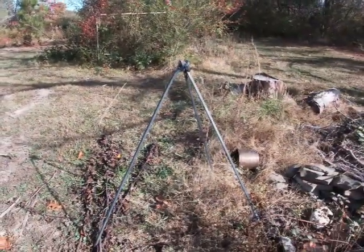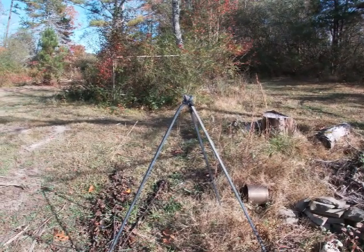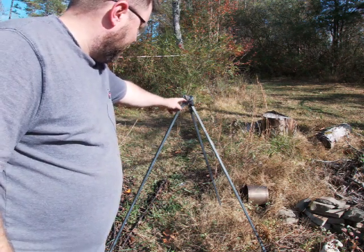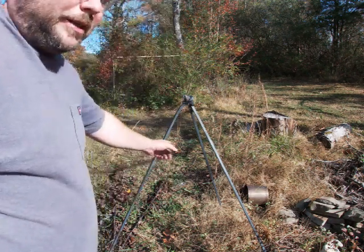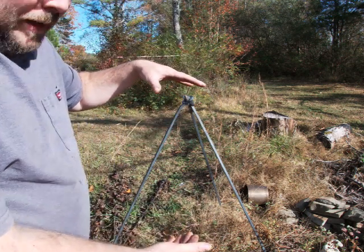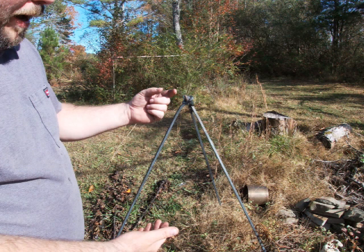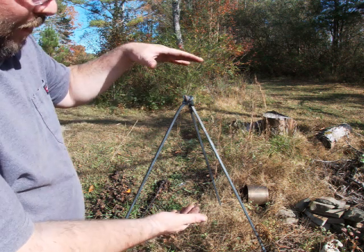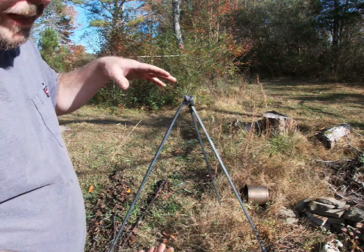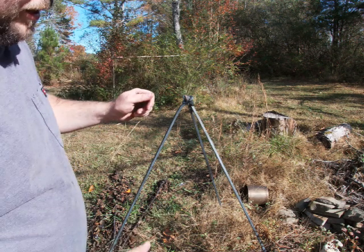Back up. Put together. Now, I'm going to talk about one of the two things we're going to be making. We're going to be making a hook called a trammel hook, which will hook right in here and hang down. Now, a trammel hook is an adjustable hook. It'll be about this big. It's made out of flat bar and round bar. So we'll be using a piece of about 1 inch wide, 1/4 inch thick, and probably about 1.5 feet, 2 feet long. And then your other piece is going to be 3/8 round bar, the same length. And what it has is a series of holes in it where you can adjust it up and down.